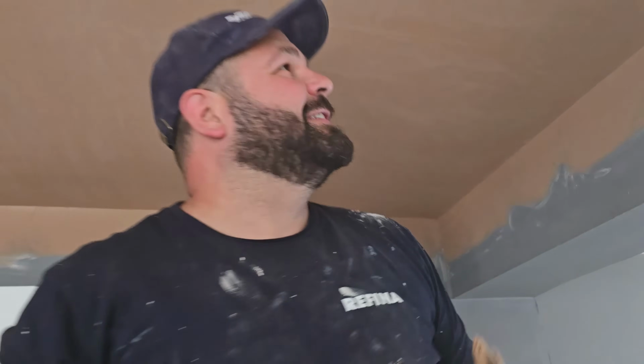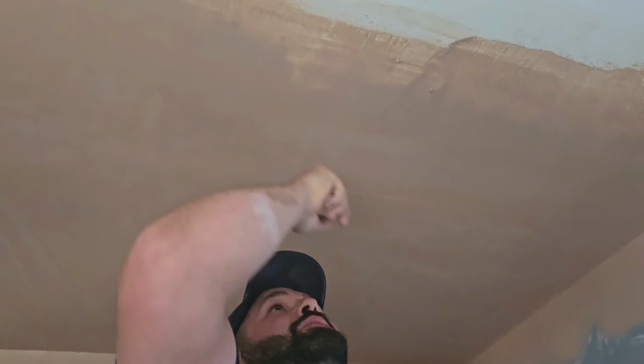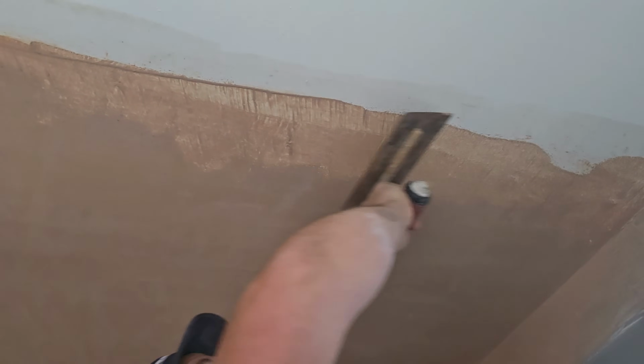It's imperative. Imperative, that's a big word for me. When you're blending in, don't go that way with your trowel because you will cause a little bump. You've got to use water. You've just got to, okay? Just trust me with that one. And then go across it like this. Because what you want is to never see that join. There's fellas that always say, you'll see the join. I promise you, if you do it like this, you won't.